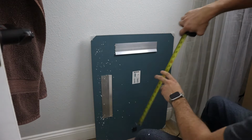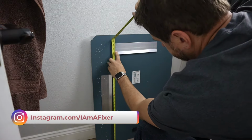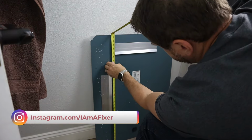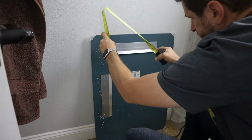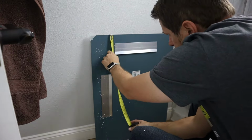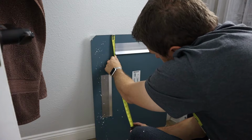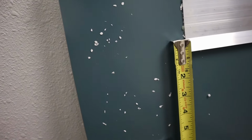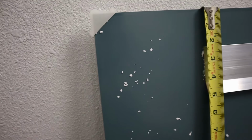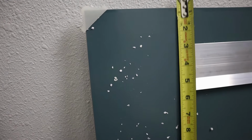If I want this to sit almost on the top of that backsplash, from the bottom to right under here, which is where that mirror is going to hang, is 27 1/4. Or I could go this way if I wanted it to hang a certain distance from that light, which is 4 and looks like 3/16. The bracket is about 5/8 of an inch. That means I'm going to have clearance from wherever the finished height of the mirror is to that light. I need at least 5/8 of an inch so that there's clearance to set the mirror in there and then have it drop down.